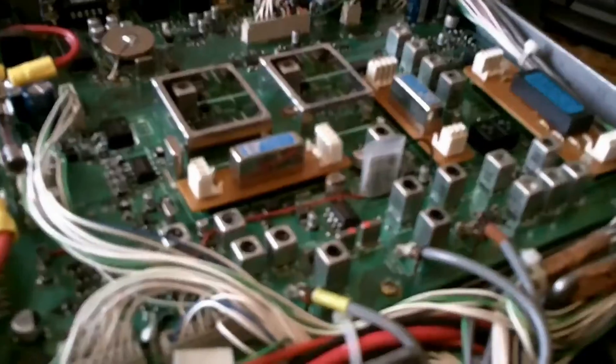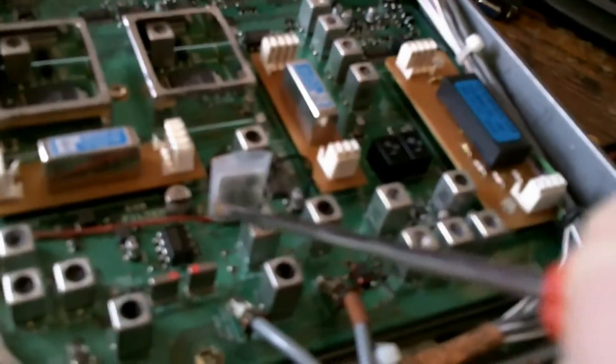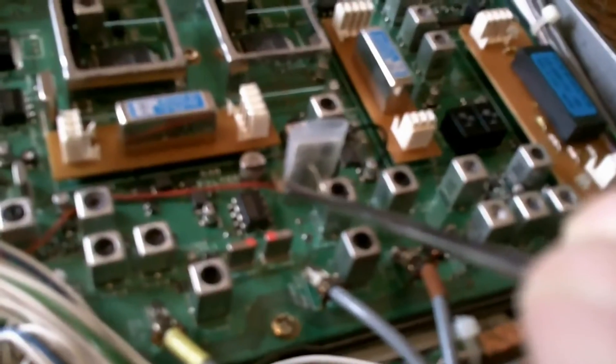I'll see about that once I've soldered it in position. So far so good. Okay, it's all in position and soldered — not quite as beautiful as I'd hoped, as this wire trails across to the 8V regulator point. I think I might be able to take the voltage from this resistor here; it does measure 8 volts, very close, and could keep the wire very short. But for now I'd like to test it taking current from a proven place. I'll put the link for the website I got this from at the bottom of the page.